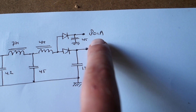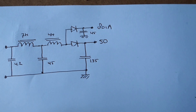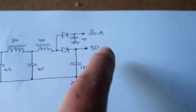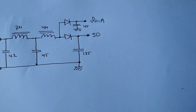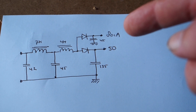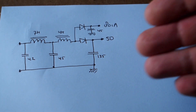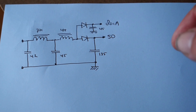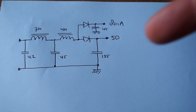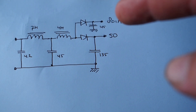The clarity of the signal and the quality of amplification - it was very obvious that the change in the B+ caused by the Type 50 was actually influencing the sound. I always wondered what the fluctuation in B+ on a tube actually does and whether it was audible, but I think it really is. It's just not a good thing that it changes, because officially the operating point shifts only slightly and yet it is actually very clearly audible.